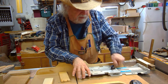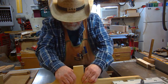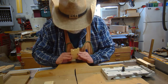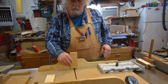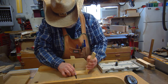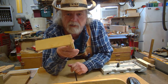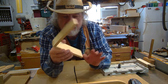So let's hog the rest of this out and see if it fits. Now let's see if this likes to fit together. Needs a little cleanup — not unusual on my dado set. I did get tear-out because I did not have any kind of backer on this before I started cutting. Normally if you do that you won't get the tear-out and it makes it look much better. But it's a good tight joint — put a little glue on that and that thing will stay together at 90 degrees.